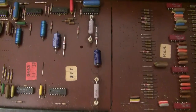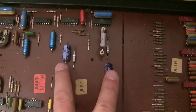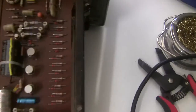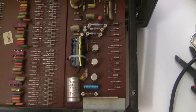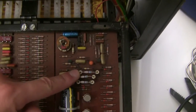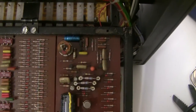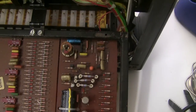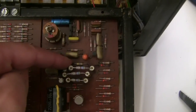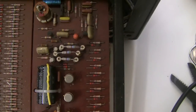But over here on the control board, I've changed these resistors and changed these capacitors that are part of the power supply rail that's found on this board. And over on the master oscillator board, I've changed the capacitor that's part of the power supply. And then we noticed there was some paint flaking on these old resistors here, and what I thought was a charred resistor down below, and I replaced all those with higher wattage, even though they're actually smaller, higher wattage resistors. The resistor down below, it turns out the black stuff wasn't scorching, it was a discoloration from the glue